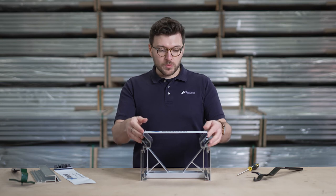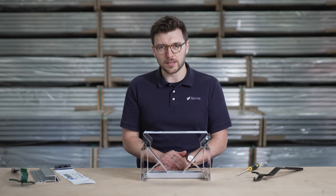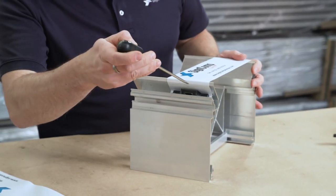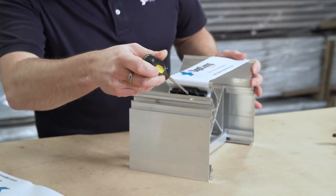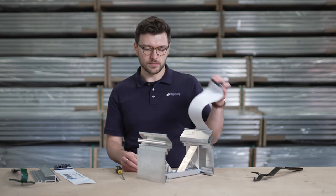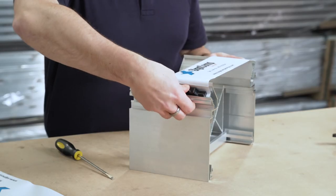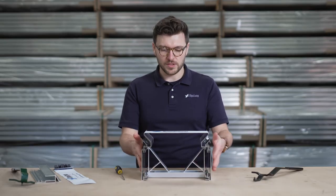The way that our clips work is virtually impossible to get them out — and that's why we haven't had a failure in over 30 years. But if you want to get them out, all you need is a flat head screwdriver. You place the flat head into the gap and just twist it to disengage the teeth and detension your print. You change the print, maintain the LEDs in the sign, whatever you need to do, and then reinsert your print. So that's our Econoflex system.